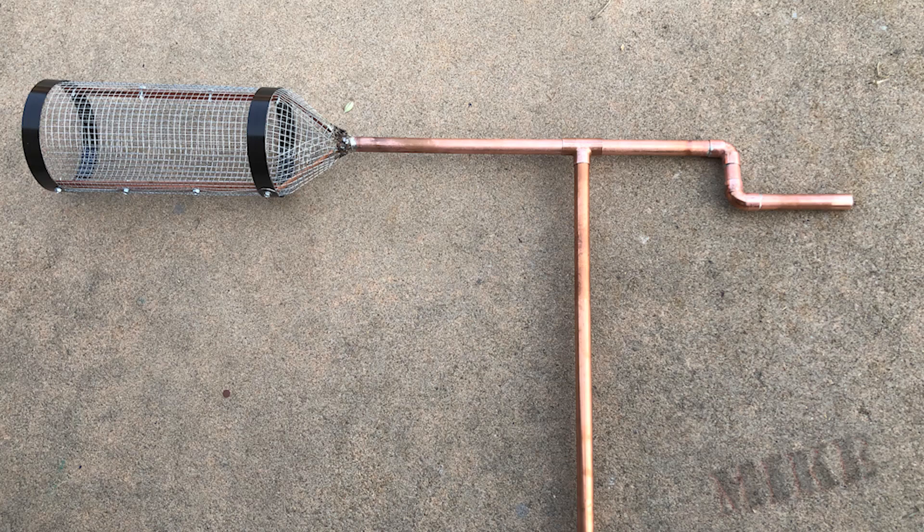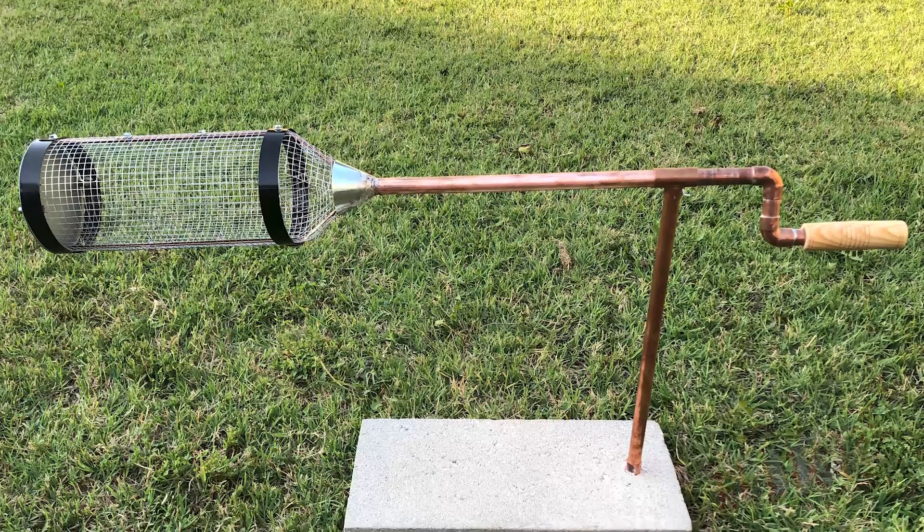The problem with this one was that it got so hot inside the little tent that my friend made, the solder joining the mesh to the copper actually melted. And this is quarter inch mesh, which was a little too big for some of his coffee beans and they fell through. So it was back to the drawing board. But it all pivots at this central T that I bored out with a five-eighths inch drill.